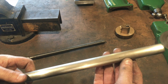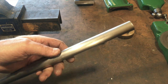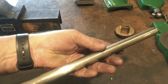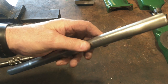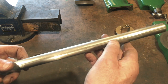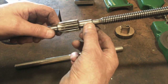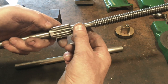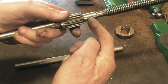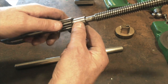What I've got here is a bit of bar — it's the remains of an old press ram and its hardness is between 45 and 50 Rockwell. The screw has a Rockwell of less than 45, so I think this material was well suited if I can cut it without marring the thread faces during the finishing operation. My plan is to hacksaw the Acme screwed section off the whole unit and, after making a new threaded section, press it into place making the unit whole once more. Simple — or at least that is what I was hoping for.